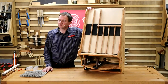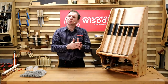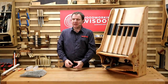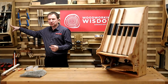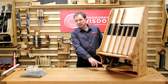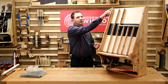Quick question: are there any plans for these? No — it's one of those things. My best answer really is: what do you want to put in this? Do you have the same range of planes? Do you need it as wide? Start with a piece of plywood, draw something up, look at your heights and needs, do your designs. I drew these all out in plywood and probably spent a day drawing up the designs, working out and playing around with different ideas. Each of the boxes on the wall is a different shape. I've got three different shapes. Once you've got your shelf positions worked out — lower shelf for block planes, upper shelf for fours upwards, longer shelf for longer planes, shoulder planes on top — then you start to build the shape around all of that.